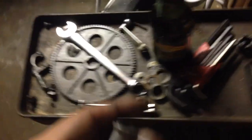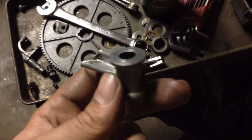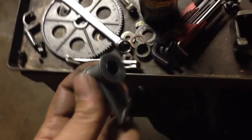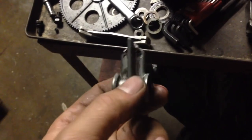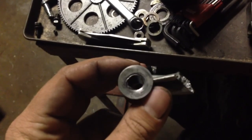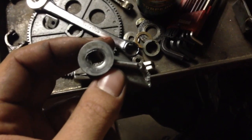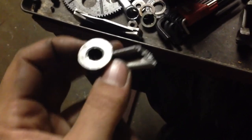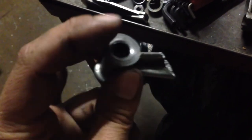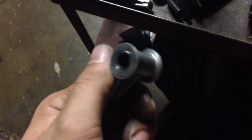The change wheels are of course more expensive to replace. When I remake this out of aluminum or whatever material I choose, it's probably not going to have that sacrificial property anymore. My thinking is to bore it out larger and press a bronze or brass bushing in there that's large enough that should something happen, it would just press that bushing out instead.